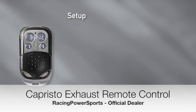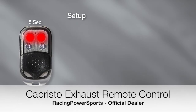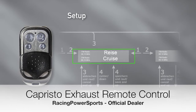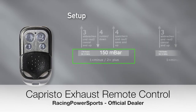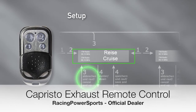Within the setup the buttons have the following meaning: button 1 — backward or minus; button 2 — forward or plus; button 3 — escape, backward or cancel; button 4 — enter, confirm or save. To get to the setup, press buttons 1 and 2 at the same time for 2 seconds. Set up appears on the display. Press button 2 to navigate right to the first parameter. Now go down to the parameter with button 4. Change the parameter with button 1 for minus or button 2 for plus. After changing the value, confirm with button 4. If you do not want to save the changes, cancel with button 3 — you automatically get one menu level up. To exit the setup, press button 3 again and the display shows OK.